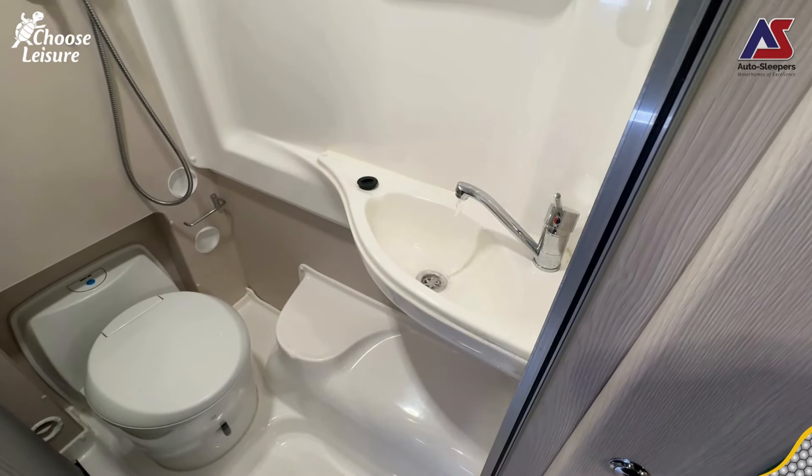Just make sure the shower's not full of air as well - run the shower too, just make sure you're not standing in it fully clothed obviously. Sometimes I close one tap and come back onto the other and open that up as well, just to help prime the system, alternating between the two. It can take a good 10 minutes to prime it all through depending on how far the boiler is from the taps. We're beginning to get a nice steady stream of cold water coming out of the hot tap in the kitchen. There we go - cold water coming out of the hot tap. A shorthand way of thinking about it: if you've got cold water coming through the hot side of the tap, it's got to be coming through the boiler, so both sides are primed and you can start demanding hot water.